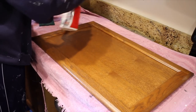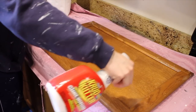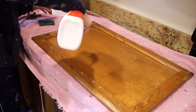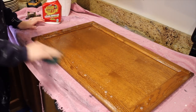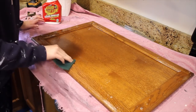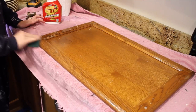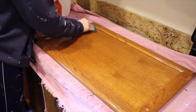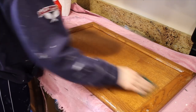Here's the really important part: you've got to clean these cabinets so well. I start with Crud Cutter — it is a degreaser. Get it nice and soaked all over the cabinet doors, and then I use a Scotch-Brite pad to really scuff it up as I work, which also scrubs off any grease. Most kitchen cabinets like this have not been properly cleaned in about 20 years, and that's fine, but you've got to get all that grease off so the paint has something to really stick to. Give it a really good scrubbing — you'll be amazed at what comes off.